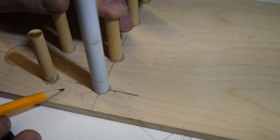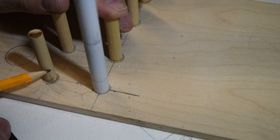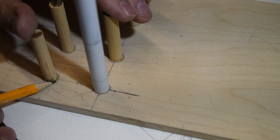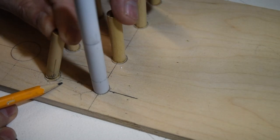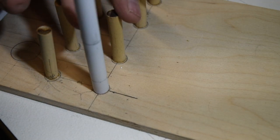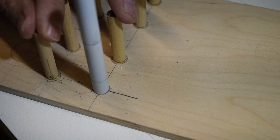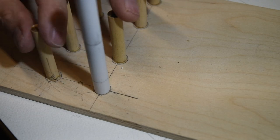Or you can do this on a drill press as well, a nice square drill press, and get these pegs. But they're still not going to be perfect. So if you just glue them to the surface here, you can crack them off like that if it's not straight, or just reattach them with CA. That's what I find works best. If they're drilled and glued into the plate, then you're not moving them if they're not straight. So this one can easily be reattached.